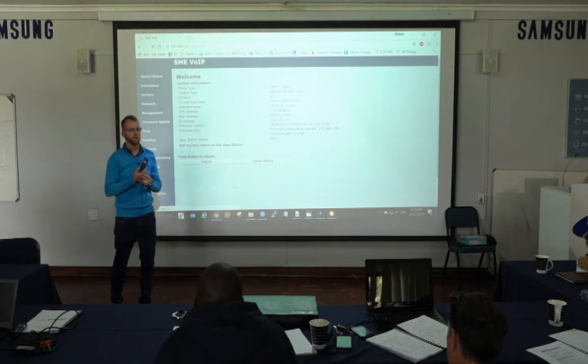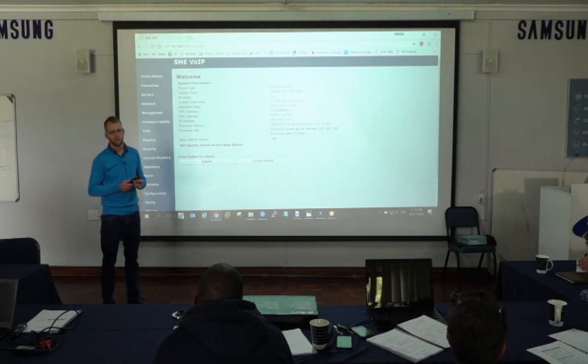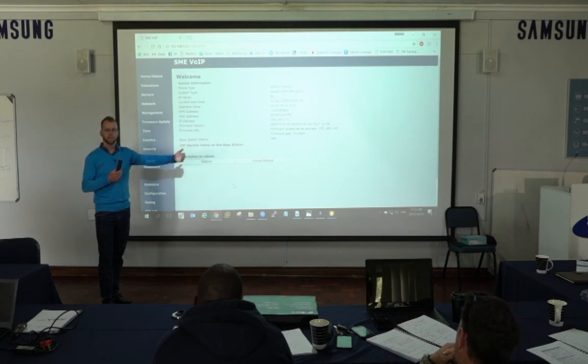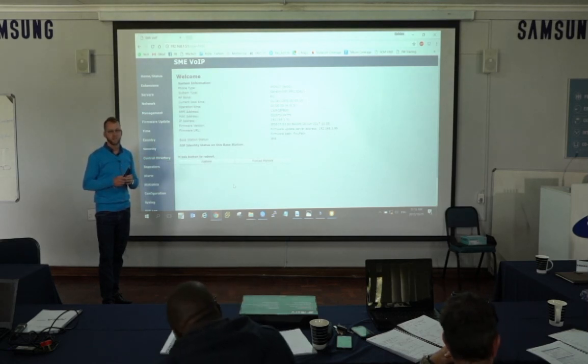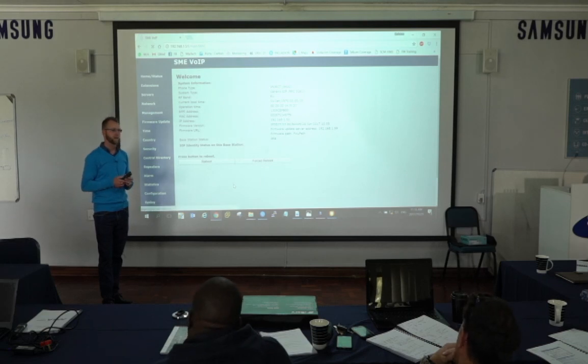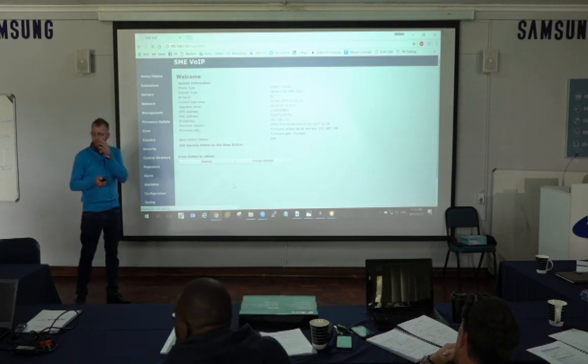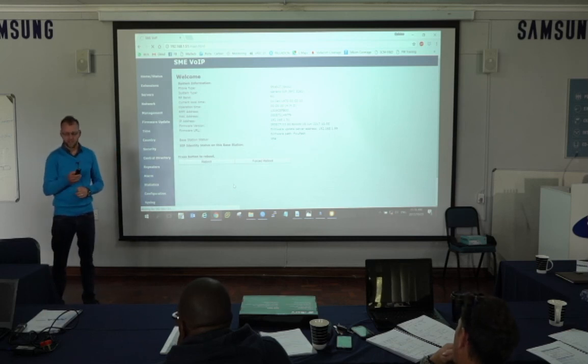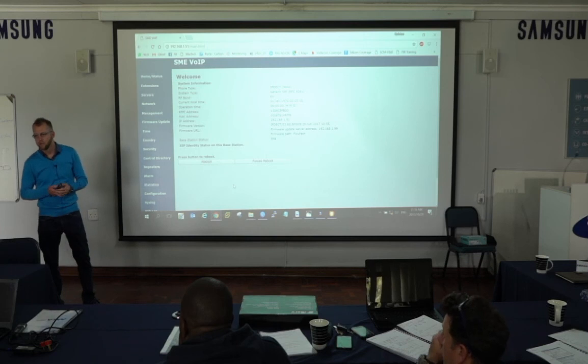The site survey mode, you enable that when you have repeaters on the network, on the base. Every repeater will have an RPN number, so you can see the signal between this handset, the base, and the 3 repeaters there. Then you know where your signal is coming from. We need to put that on even if we don't want it to? No. The site survey mode will only be for installation purposes and troubleshooting, diagnostics. Yeah. Not for application.